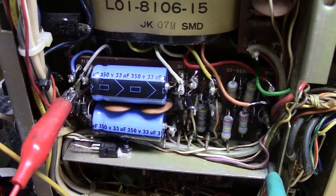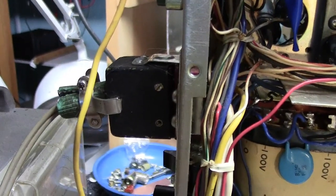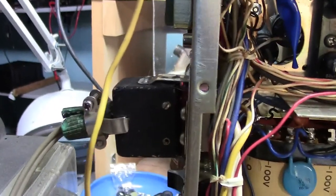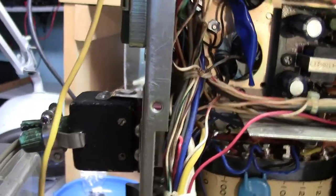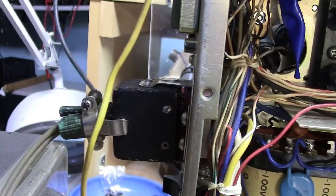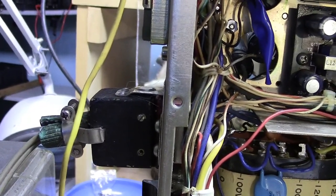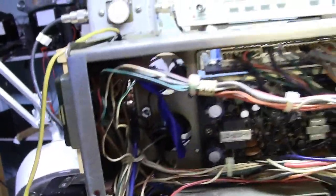Your receiver will activate. Now if you look right here, I do have the AC plug stuck in the back of this thing. You have to have the plug in, or I believe it's pins 8 and 9 you have to jumper together — otherwise it won't work. There's an internal connection on that little black box you're seeing to your left. The AC cord jumpers pins 8 and 9 together, which applies the DC to the solid state. So you have to have the back plugged in.